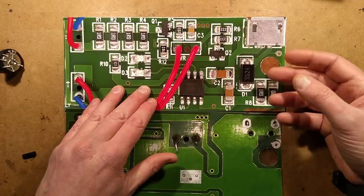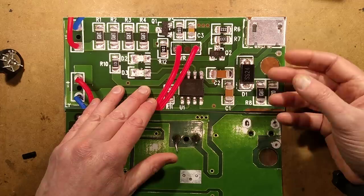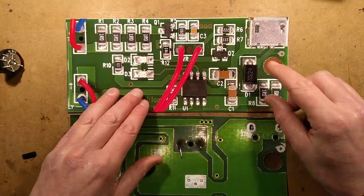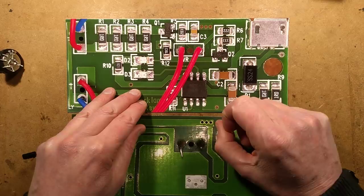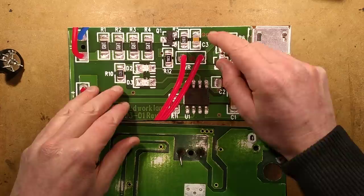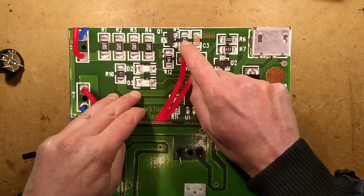The USB connector uses five pins; the middle pin is the only one not connected. The two pins on either side are used partly to indicate to a connected device what type of device this is, and also for strength and a larger connection area. Now, the interesting finding: there are two MOSFETs here. This MOSFET had failed — it wasn't switching the LEDs. To test it initially, I jumpered over the resistor and they glowed, confirming the fault.